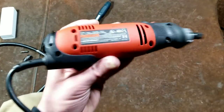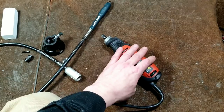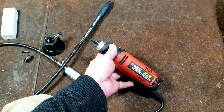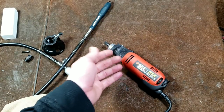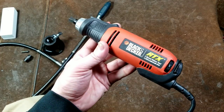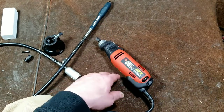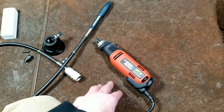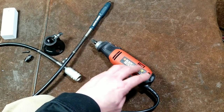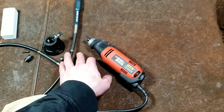I also forgot to mention: this RTX 3S is rated at 2 amps. Even though you can't replace the brushes, it's easily as powerful as any Dremel — in fact most Dremels are rated for only 1.15 amps, so this unit is definitely as strong if not stronger. I'm going to follow up with a quick, heavily edited video taking it apart, showing the inside, and modifying the speed switch, and then I'll continue with my various Dremel reviews and comparisons.